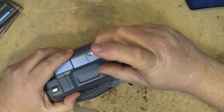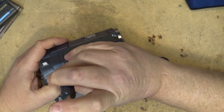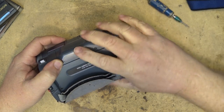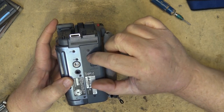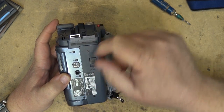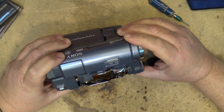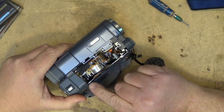I'm going to start removing the arrow-marked screws and that should get me in. This is like a 2004 model and I left the service business in 2003. Most of the ones I worked on have the mechanism the other way - the tape goes down from the top. This is one of those designs where the tape ejects from the bottom, which I thought was one of Sony's dumber designs - they copied JVC's. If you've got the camera mounted on a tripod you have to take it off just to change the tape. Anyway, there's the top cover off, exposing the ribbon cables, heads, and loading guides.